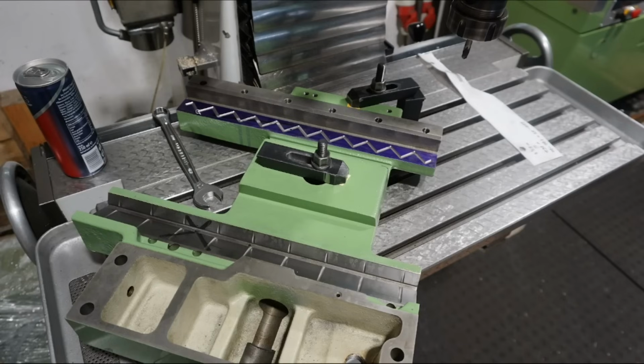Here is a picture of machining the oiling pocket on the flat slide, and you may have noted that I use a ball end mill to do this, so that the pocket kind of softly transitions into the sliding surface. That way there is sort of an oil wedge, and an oil wedge, whenever the bed slide is moved, contributes with hydrodynamic lift, so that the chances of the sliding surfaces having metal on metal contact and wearing away are lessened.